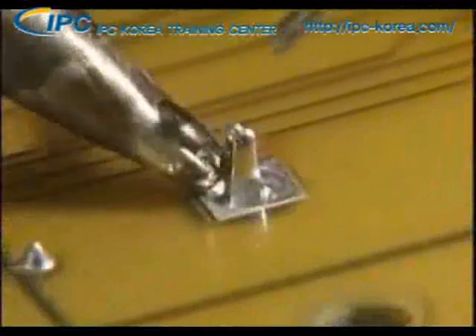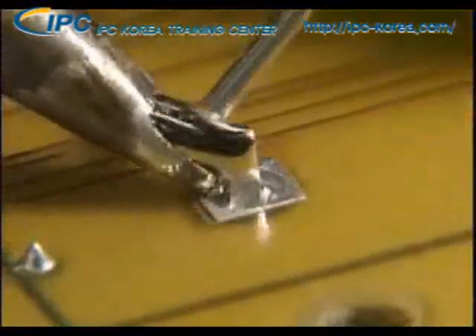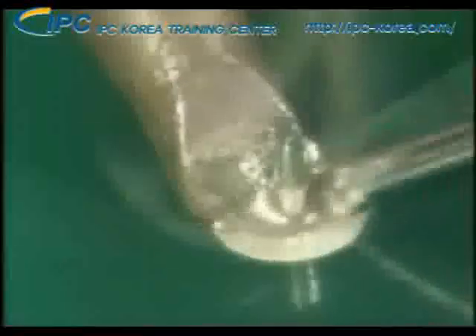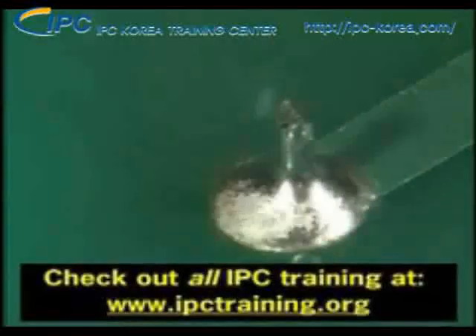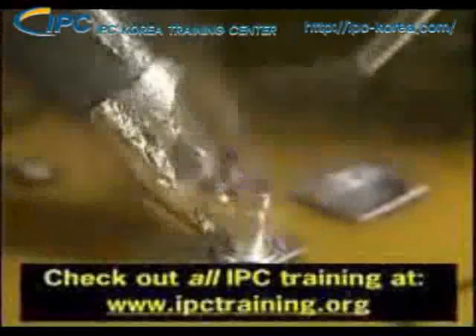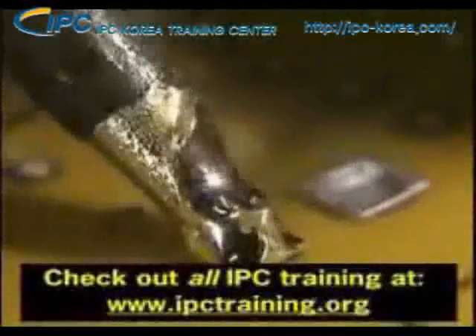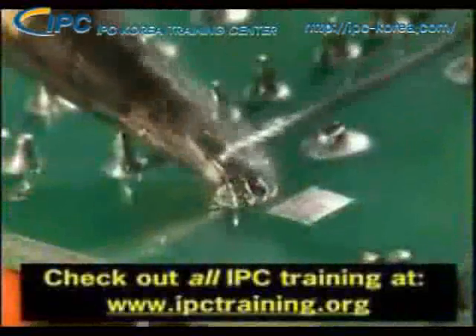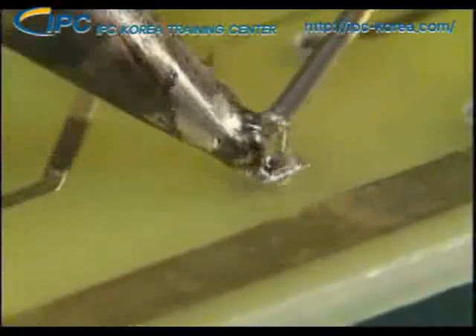Another tip life factor involves feeding the solder onto the tip to force it to melt. This is different than quickly touching the solder to the iron to create a heat bridge. When the solder is continually fed onto the tip, the active fluxes cause rapid surface oxidation which forms pinholes in the plating. The tin eats away at the copper, causing the holes to enlarge. Once the copper begins to dissolve, the tip becomes unusable.